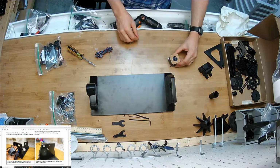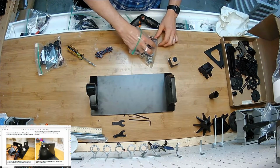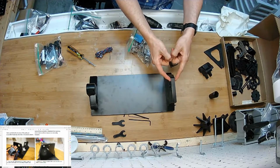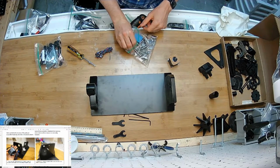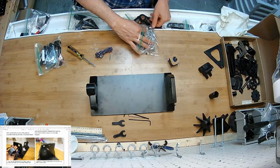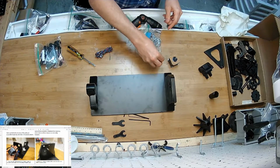I did want to have some sort of buffer between the metal and the plastic, but they operate at temperatures that are safe for the plastic. I actually print any part that touches the motor out of PET G to give it a little extra temperature resilience, but they are designed to stay at a happy temperature.